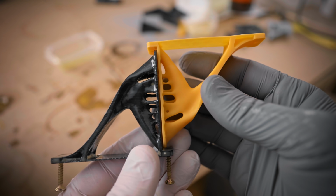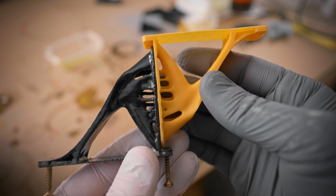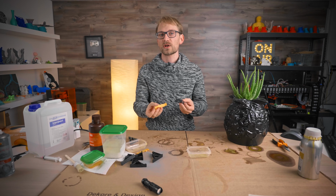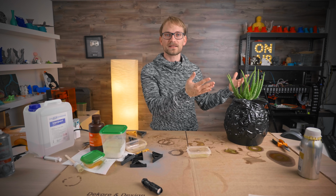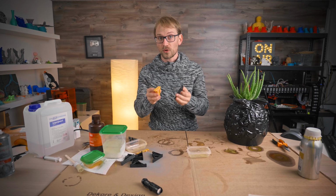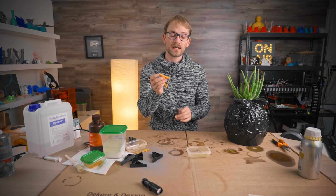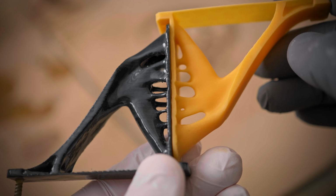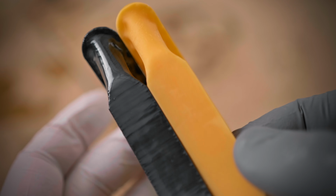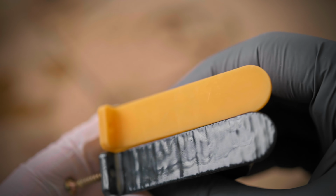print. I guess you could still spray paint the resin print and get that, but unless you have a crazy massive resin printer, you're not going to get something, you know, this size. These brackets are normally over 3 times this size, and I think at that scale, losing a bit of detail from the resin finishing process isn't much of a problem at all, unless you've got a part that does some mechanical job. But with resin coating, you can always mask off surfaces that need to mate with other parts.